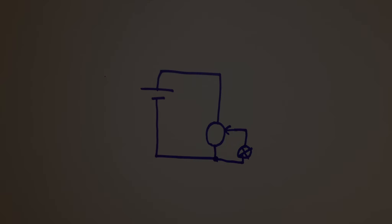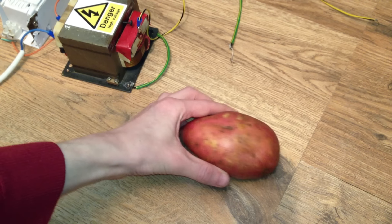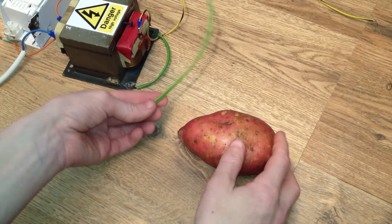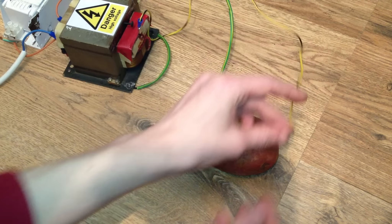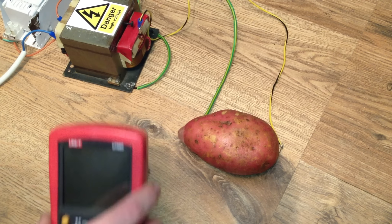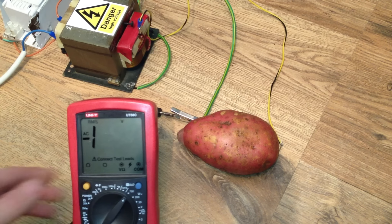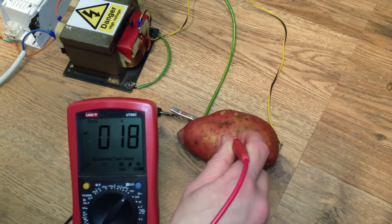In my mind. So I'm going to use a red-flavoured potato to test this, and my power supply will be this high-voltage transformer, because the resistance of a potato is so great that it simply won't work on lower voltages. So I'll connect it up just like a potentiometer, and then if I grab a voltmeter and connect common to ground, I should be able to tap off anywhere along the potato to get any voltage that I need.